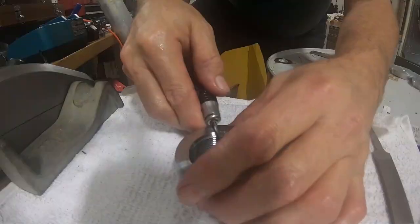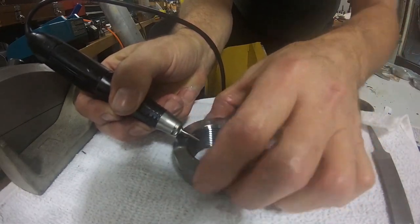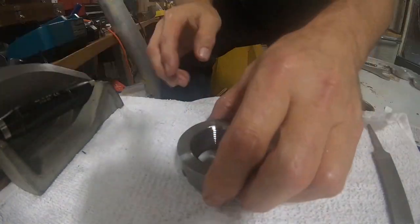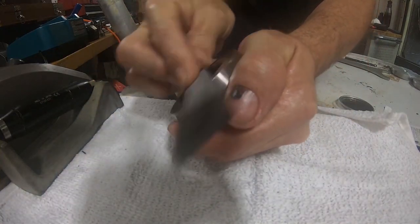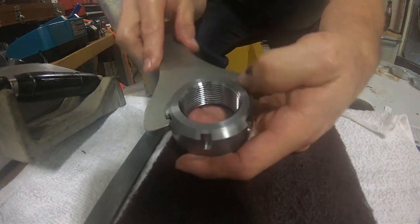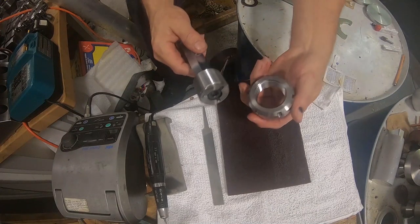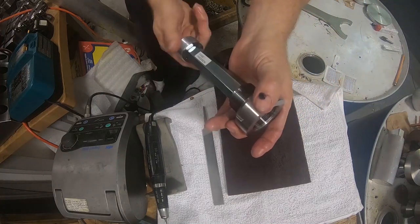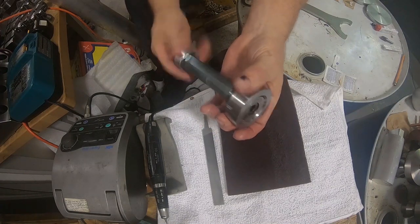And breaking the burr off with the pliers, and deburring the back with my NSK pencil grinder. And I file it a little bit. It's a real fine file like I keep just for this kind of thing. Notch bright. I'm going to check to make sure the gauge still went through. We didn't have a burr or something there. It seemed to be okay. So that's the nut. It's going to go on this fixture for the sleeve.